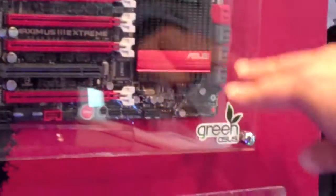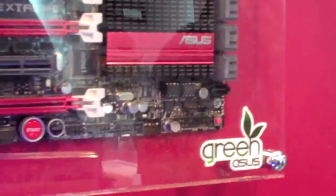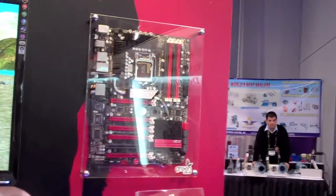A couple of things we're finalizing: we've got dual BIOS, and we're considering an option called ROG Flashback. What this is going to allow you to do is, in the event that one of these BIOSes crashes and your system can't post, through ROG Connect you could have your ROM file on here and emergency override that BIOS to get your system back up and running. So a lot of really nice innovation happening here for our pinnacle performance board, the Maximus III Xtreme.